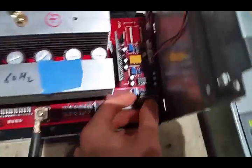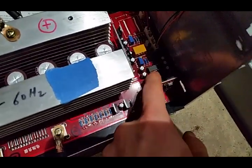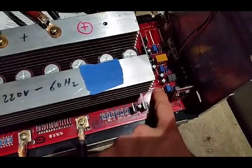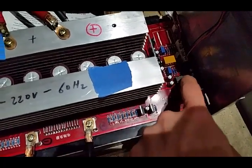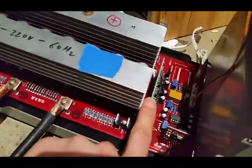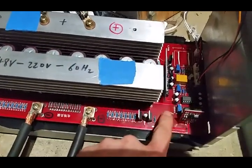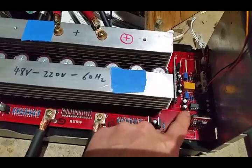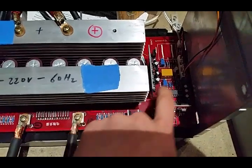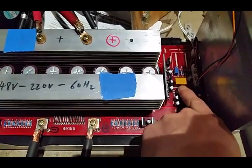It did that a couple of times and nothing happened, so I just kept going and eventually it blew up. I suspect the very high impedance of this op-amp, coupled with the very close proximity to this DC-to-DC converter — there's a huge inductor right next to it with a lot of noise coming off it — and that noise going in on that line, which normally sees very low voltages, induced even a slight voltage on the input that got amplified. This controller looks for 0.5 volts to shut off from either short circuit or continuous current cutoff, so I've just circumvented the short circuit current completely since I have other redundant safety measures in effect.